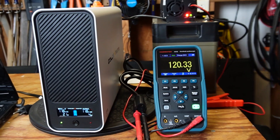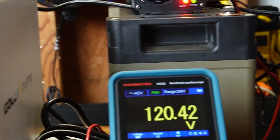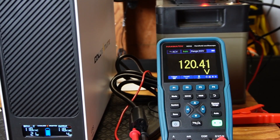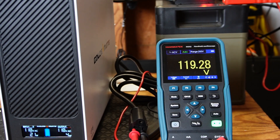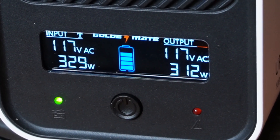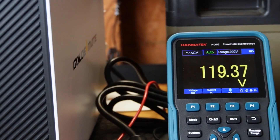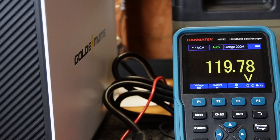I'm going to try that again with a little bit of a load. I have a battery charger plugged into the back of the UPS right now, hooked up to the Orion 1000 battery I just recently reviewed. The battery charger is drawing 312 watts. Now let's watch the voltage as I unplug the UPS from the wall. I think I saw 109 to 110 — so just a little dip. Of course, it's switching over in less than 20 milliseconds. I'm getting ready to test if it's fast enough — that's my next test.